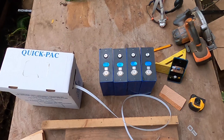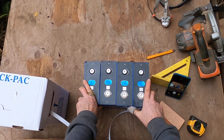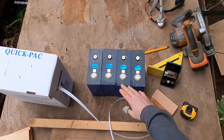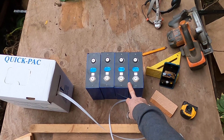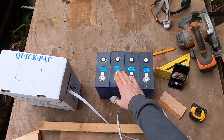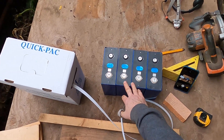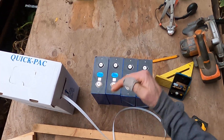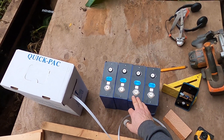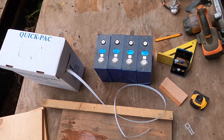What we're going to do is have 16 bundles of four cells each. Each bundle will have four cells connected in parallel, and they will function as one cell altogether because they'll be able to share voltage over the terminals. So we'll have 16 of these bundles of four connected in series to create a 48 volt nominal battery bank for our new system.